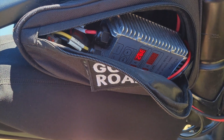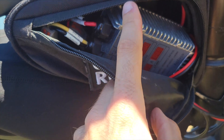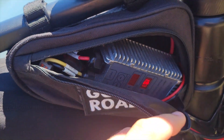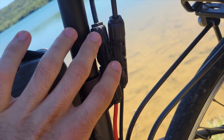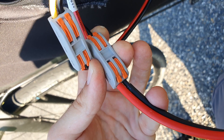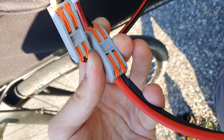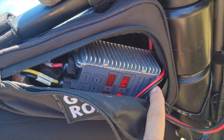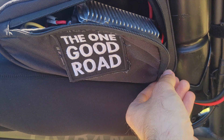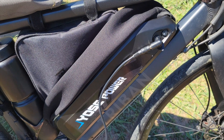It's really simple and lightweight — you don't need a giant battery with an inverter. You do have to do some manual cabling: I got MC4 cables without plugs on the end, then plugged them into the easy clip plugs. I have some other footage showing how that works because it can be a bit tricky. Then these thick DC cables go from the MPPT charge controller to the battery. The controller is just being held in a small bag.